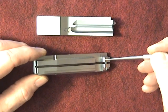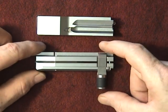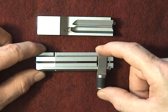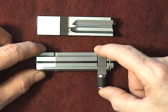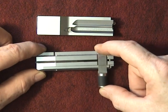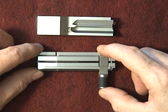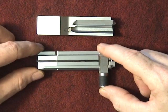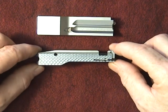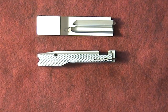The last feature I'll point out is the little 45-degree chamfer we put here. It aids in the installation of the cocking handle when assembling or disassembling the rifle — it makes it a little easier. If you're just within a sixteenth of an inch or within a couple of degrees of alignment, it'll pop right in. Whereas if you have square corners and you're not perfectly lined up, it can be really tough getting these in and out if you're not experienced with it. Honestly, it does absolutely nothing for function, reliability, or accuracy — it's just a nice feature when you're taking the rifle apart and cleaning it. It just makes your life a little easier, and we might as well add it in.